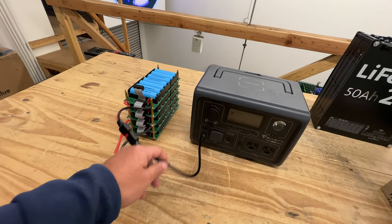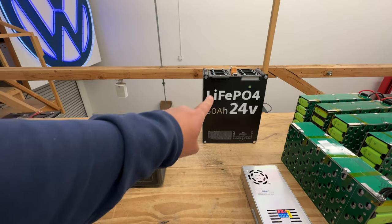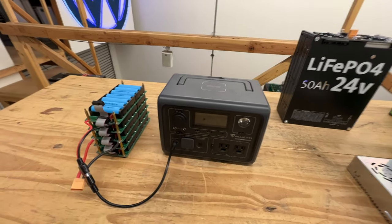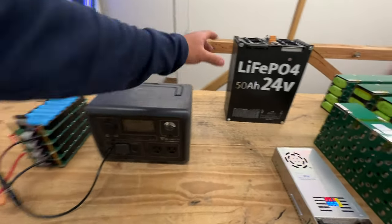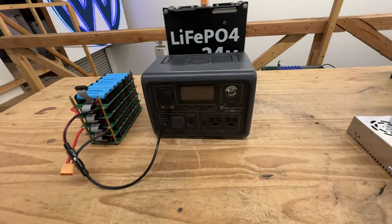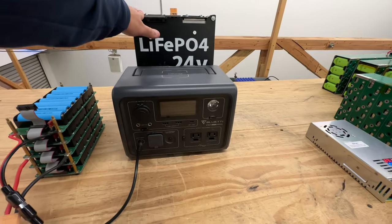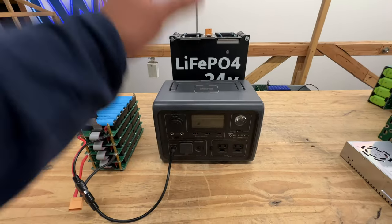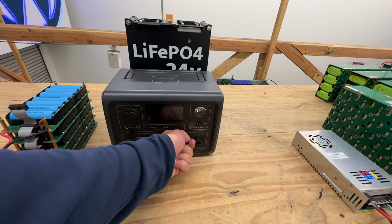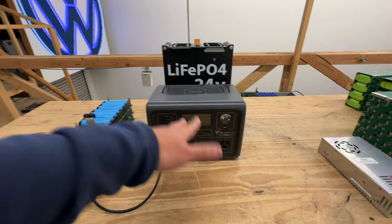All you have to do is adapt the cables — I will include links to cables in the description so you can use that. This is a 1,200 watt-hour, 1.2 kilowatt-hour battery that you can use to charge this at about 200 watts. It's kind of slow, but you can charge it in there. You could use this in here, and — what is it? — it's 268 watt-hours, and this is 1,200, so you do the math: it's like three to four times the capacity with this single battery. So you could have this little unit last a very long time by just connecting this in here. Obviously if you plug something in here it goes up to 600 watts, but if you're trying to replenish it from this external battery at 200 watts, then eventually it's going to run out.